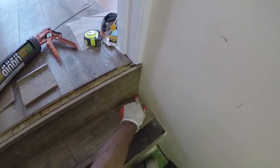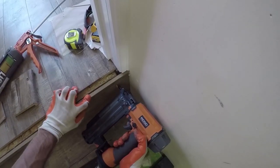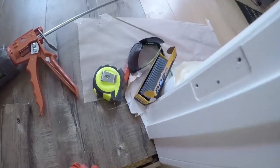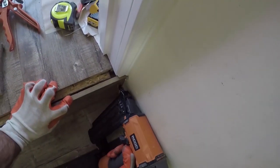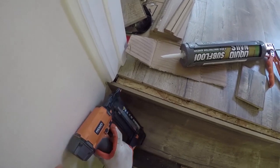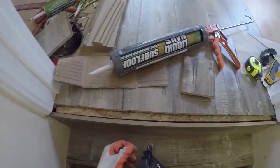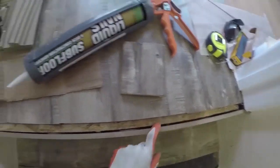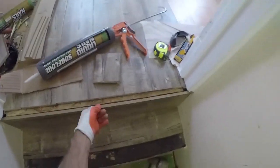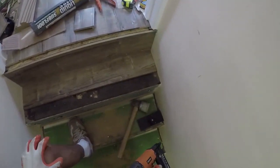The reason I use Subfloor liquid nails, Subfloor and Deck, is because when you get it on your products, it's easy to remove it with just these gloves. Okay? And now, I'm not gonna put anything there. The glue will catch it. And then I'm just gonna drive 1 or 2 right in the corner somewhere and try to drive it into that like this, and don't drive anything here. See the gap? You don't want to push all that stuff in there, just want it to catch.